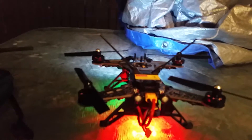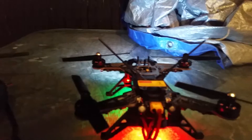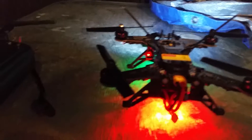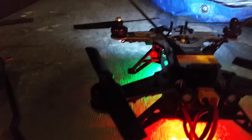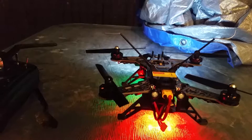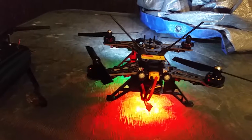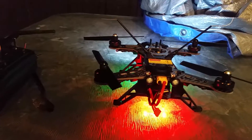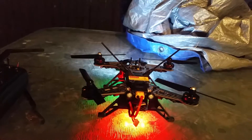I did hear there's a firmware update that will fix this problem, but the whole flip of death — it's real, believe me. So I went into the sub trims and kept pressing down and at about 13.5 the motors will kick on. Leave it there and then you're going to have to turn your throttle hold on. You just turn on the transmitter, unlock the motor like you normally would, but the motors will not spin until the throttle hold is taken off. It actually works pretty well.